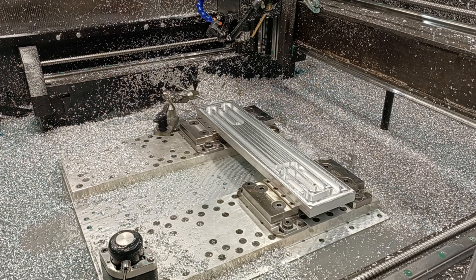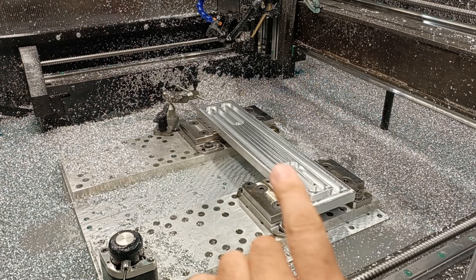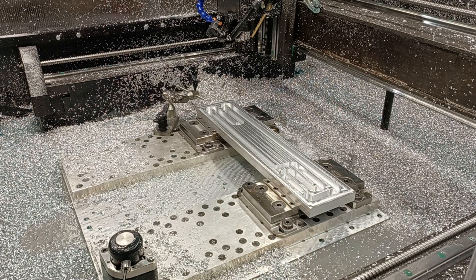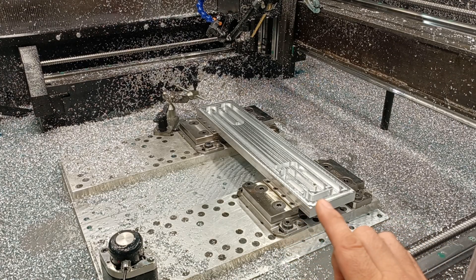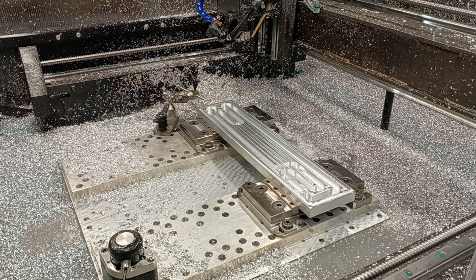Also it's aluminum, so you could load those up when you're slotting. Here's the thing - this end mill only has three-eighths of an inch length of cut, but I have to bore a hole five-eighths deep just for the thread. As long as there's enough room for the chips to get out of the hole, you won't bind up the end mill. Make sure you're not too aggressive if you're going to bore a hole deeper than the flute, because if the chips cannot escape they will bind and snap the end mill off.